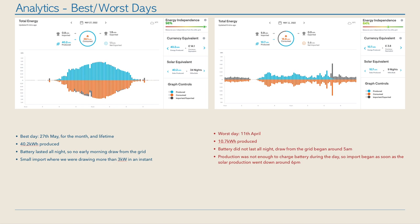On our best day, looking at the chart, the battery lasted all night — no grid draw early in the morning. We charged the battery to maximum during the day, and once the sun went down the battery lasted through the night. We're into summer now, so the solar array is producing power until about 8pm, meaning the battery drains less early on and can survive through to the morning. There were a couple of small spikes where we drew some grid power, which is because the GiveEnergy system can only charge and discharge at 3 kilowatts — so if the kettle and oven are on simultaneously the system can't provide all that power. Still our best day ever.